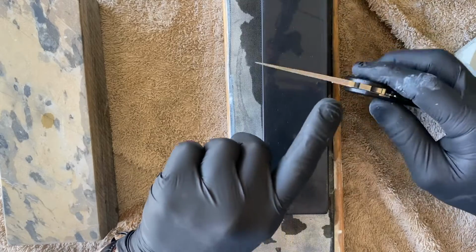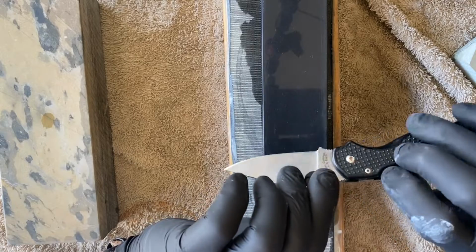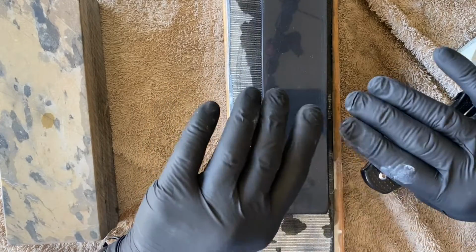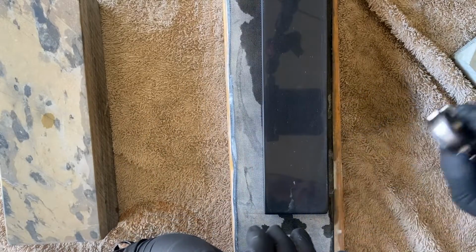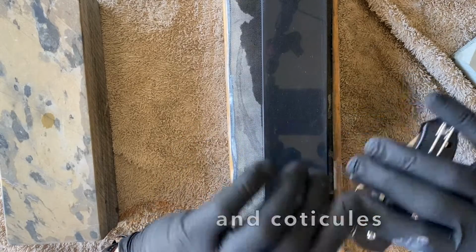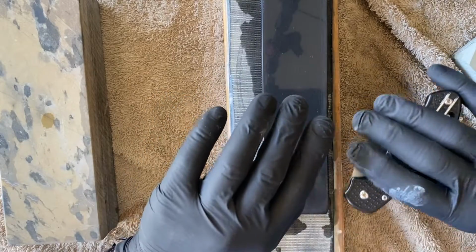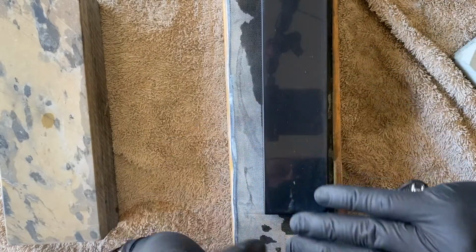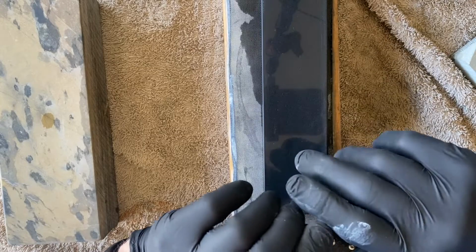Jointing is a similar thing where they essentially knock off the burr. On a synthetic stone, burrs are definitely a big problem, well, on all aggressive stones. I prefer natural stones, especially Jnats with a thick slurry, because the likelihood of getting a burr on there is unlikely, because that thick slurry keeps knocking it off. And then if you finish your progression correctly, you should not have a problem.